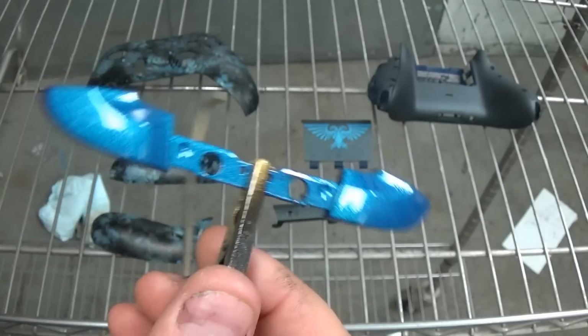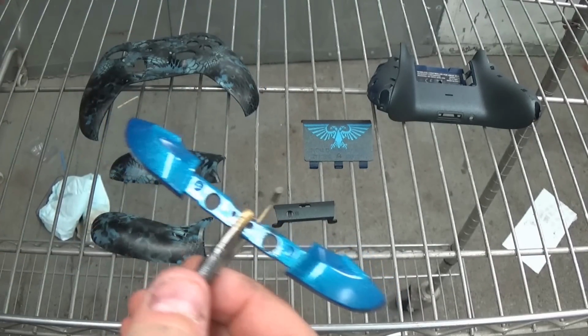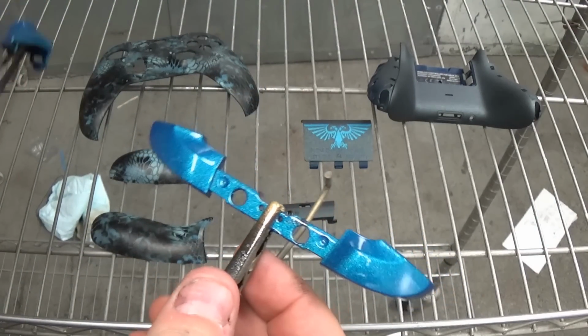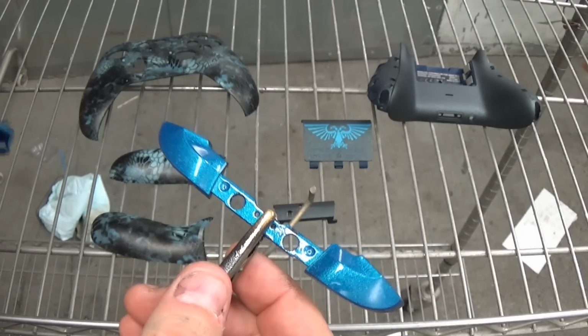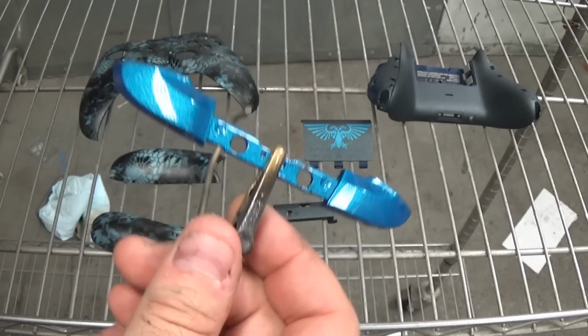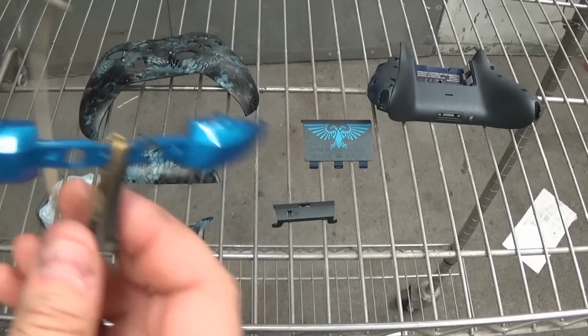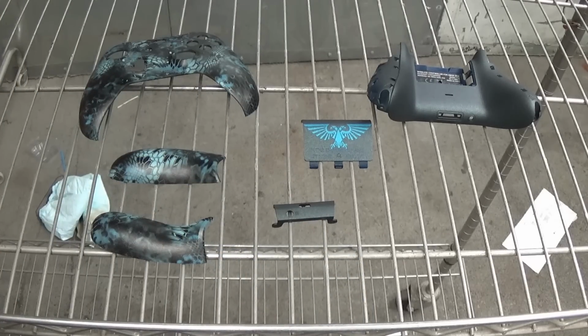So we've got all of these buttons coated. The reason we have them here in what we call the clean room or the dungeon room or whatever it is, it's a negative pressure room. Basically, there's a fan that sucks out all the dust. So as this stuff cures, no dust settles into it, so it stays nice. So we've got all the pieces we did yesterday.